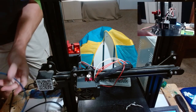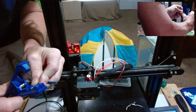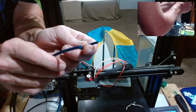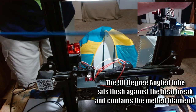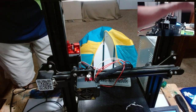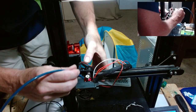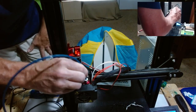What you've got here is your Capricorn tube — I've already cut it in half. Make sure that you have it at a 90-degree angle on both ends. This was the stock end so I'm not messing with that one. You get twice the tube by cutting it in half. I take the stock end of each half, so both ends I use are the factory-cut ends — the part I cut in the middle goes into the extruder gear, and the stock end goes down to the hot end.